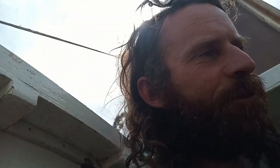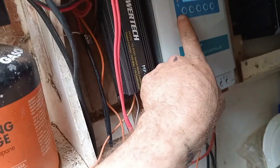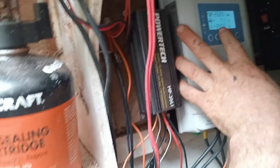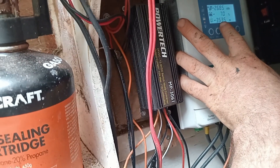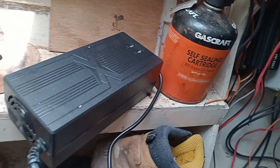Luckily I had got the sail up, so I actually sailed this ridiculous raft of two boats tied together over to the anchorage. The battery had just stopped and the display had gone off. As I got back in, I rigged up my inverter through the AC charger, and I have this wired up through the load which is telling me it's doing 350 watts — more than the AC charger is rated for at 250 watts. That probably has some inefficiency, so we're losing power. But the battery's charging.